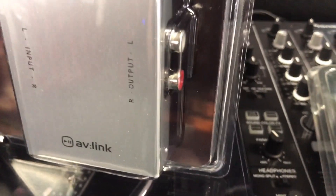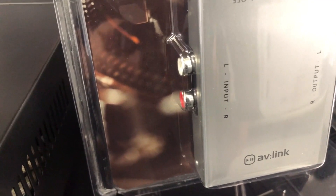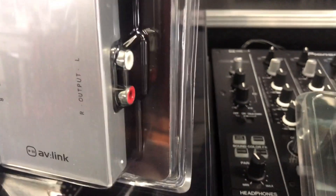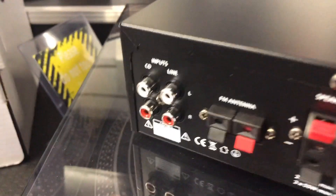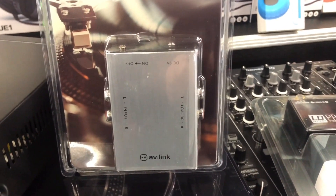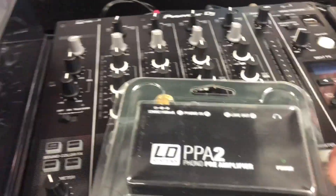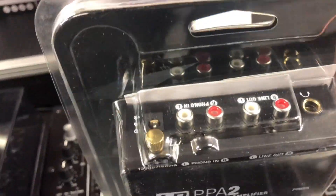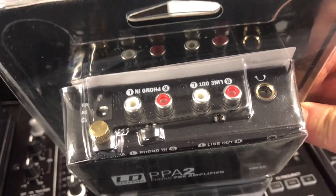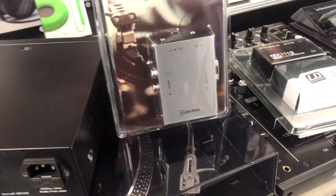We sell them here - this is just one of them. Basically, it's got an output and an input. What you do is go from your turntable to the input on this little preamp, and then from the output with some more leads into the back of your amplifier. So it just sits in between the two. I'll put some links in the description where you can go and purchase these. There's another version here made by another company - it's got phono in and then line level out - and you could add that to your standard amplifier that hasn't got a phono preamp built in.